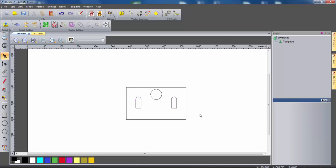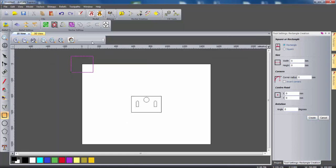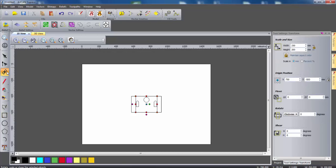The next thing I'm going to do is create the side panels of the nesting box. For simplicity I'm going to place these using first angle projection to show where they are relative to the nesting front wall. If you're American you may wish to try standing on your head and looking for a mirror and it may make more sense to you. You may also wish to reposition these in your design to make the placing more efficient on your piece of material. So I'm just going to create a rectangle again, this time with a width of 250mm and a height of 200mm. I'm going to select create, fit the model to the window, bring this new rectangle into the centre, then open up the transform tool and use the arrow keys to move this to the side.